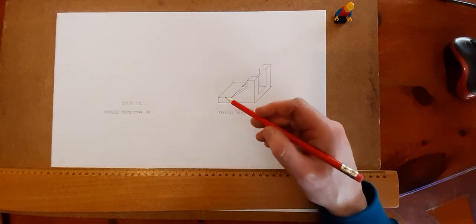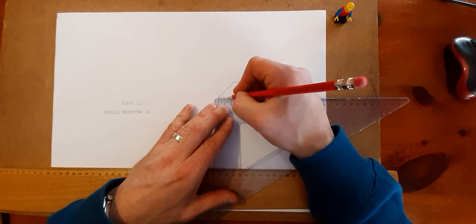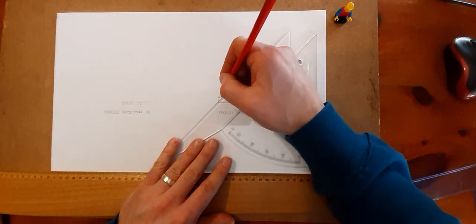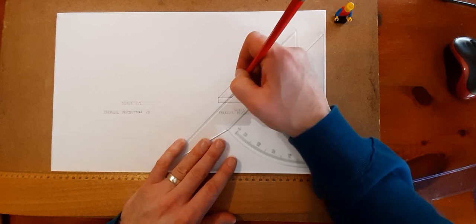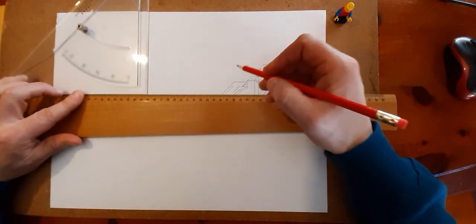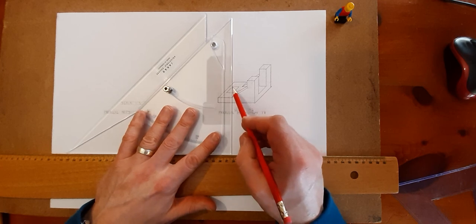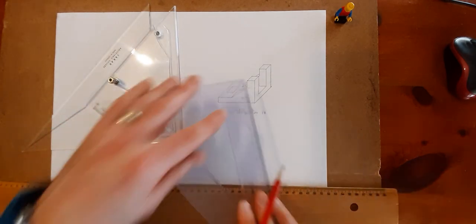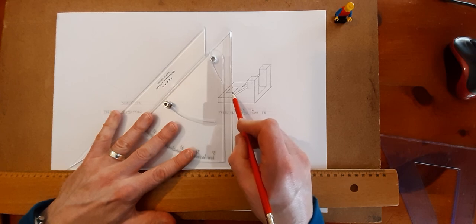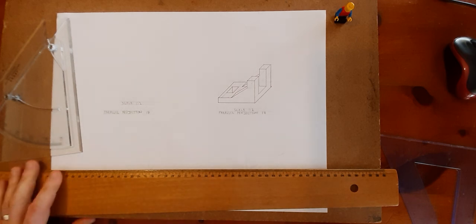And then on the front, to measure in, it's coming in 5 millimeters. And it's 20 wide, so when I scale that, that's 10. And we'll draw these two light lines across here. And then we can do them heavy when we find where they cross. Heavy line, and just don't forget to put in, you would see this guy coming down here. I'm just checking, it should be 10 millimeters. It's just a bit below 10, so we won't actually see where that finishes. That would be the isometric scaled 1:2 version of that completed.